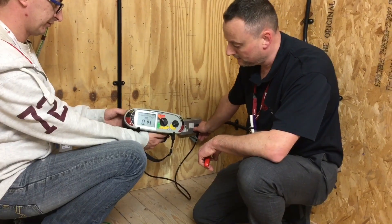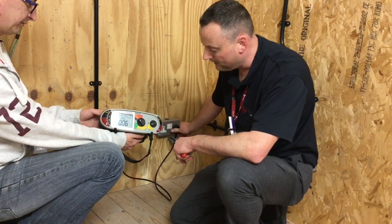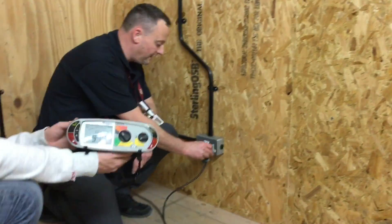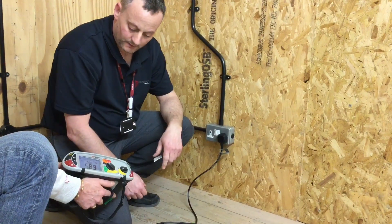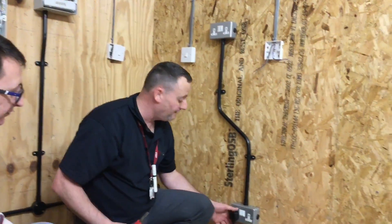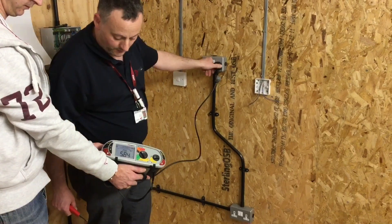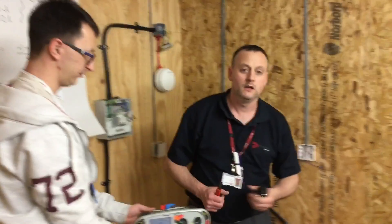On to the next side — reading is a fraction high. We have a choice: take the front off and probe into the back, or because the sockets haven't been used many times, insert and reinsert to get the reading down to a more realistic level. We get 0.03 and it goes off. On the final socket on the ring final circuit, we try inserting again and get 0.03. The spurred socket from the circuit gives a slightly higher reading — we got 0.03 on one side and 0.06 on the other. None of these readings are recorded on our test paperwork.